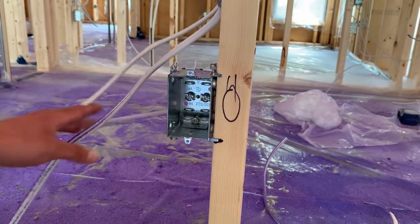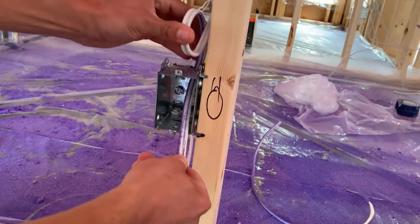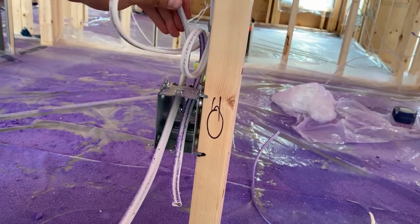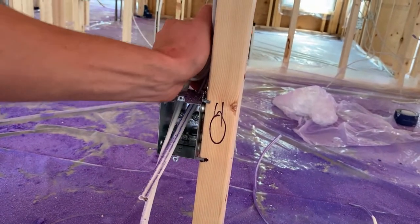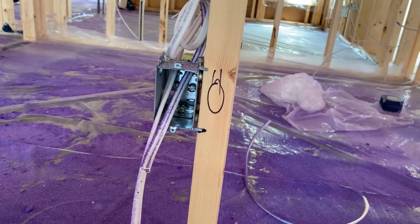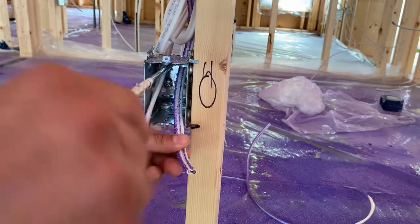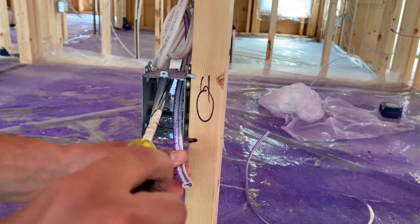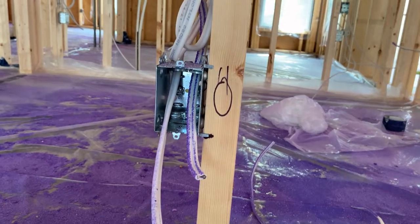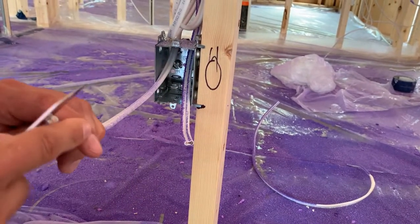As you can see, we're leaving a loop on the top. The reason we leave the loop is so that we can adjust the box afterwards — we've done it for years. We don't pull the wire exactly tight because then you can't adjust or move anything. He's adjusting it down in there now, and that connector shouldn't be singing tight — just tight enough to keep the wire from moving, but if you tighten it too much it will short the wire out.